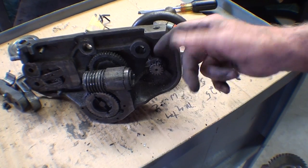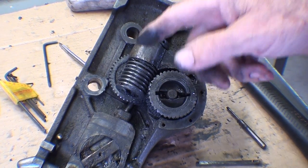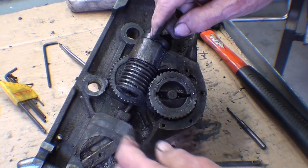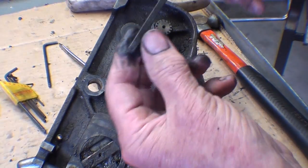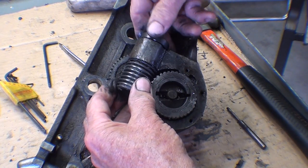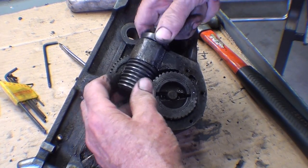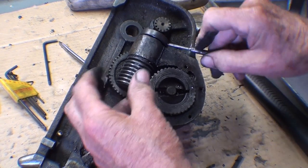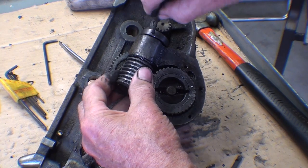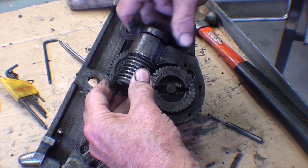There's a tiny little gear down there with hardened grease - that's probably original grease there. In order to remove the worm, there was a small pin right there that was driven into this collar. It in turn caught the key that is inside the worm, and it's crooked as a dog's hind leg, but it doesn't really matter. Now I'm able to get the collar off - it's a fine thread. At first I thought that collar was just held on by a pin, and I knew that wouldn't have any strength especially with a pin that small. This will have to be reassembled exactly as I took it apart.